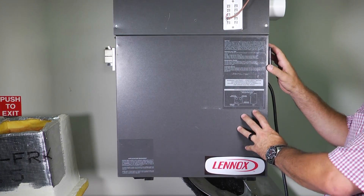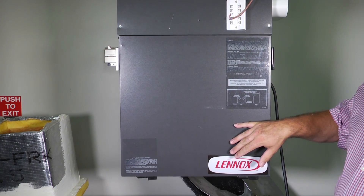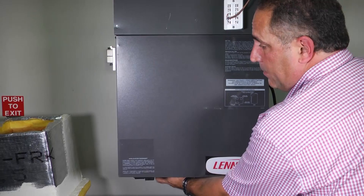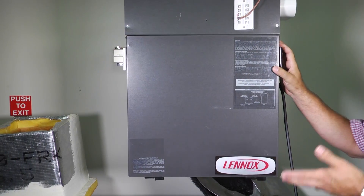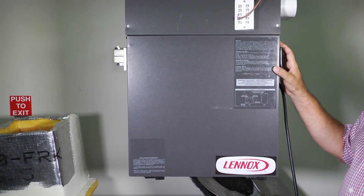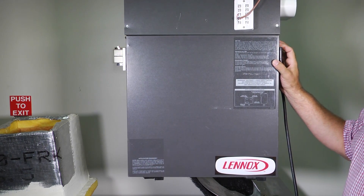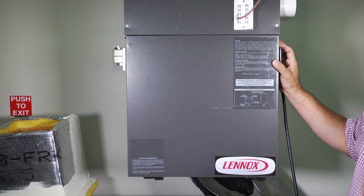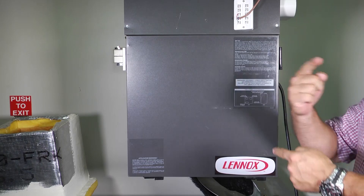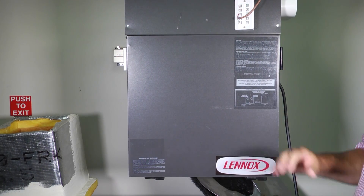The other thing to remember about an HRV or an ERV is that there are times where we are going to see water come out of it. Into the bottom of the HRV you're going to notice some holes that you'll have to put drain lines into. You're going to want to hook those drain lines up and take them to a point where we can get rid of that water. We also want to make sure the drain line is trapped — what we normally do is just take that clear plastic hose and put a big circle in it so that the water traps inside of it and can drain out properly.